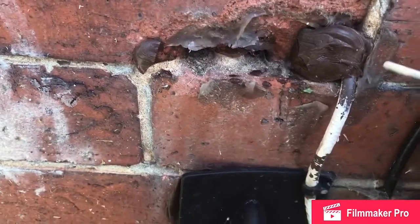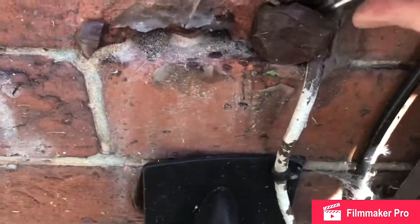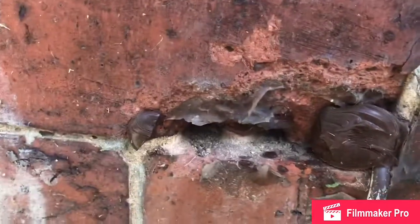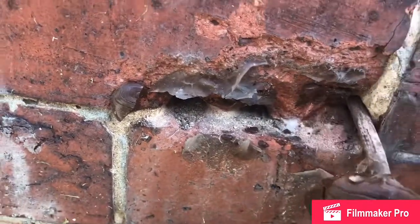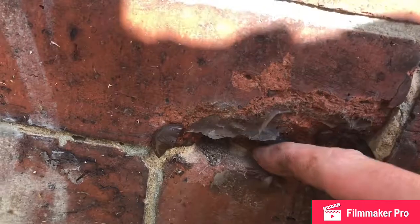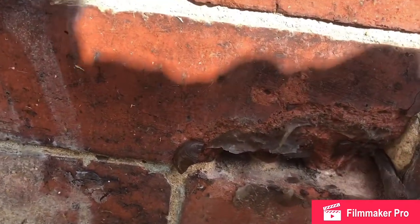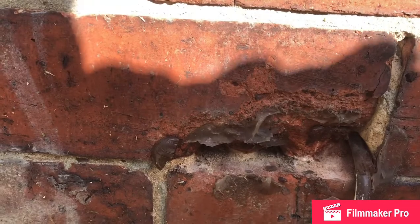It's quite dry. We did have ant infiltration. This should verify. We have had a bit of dry weather, so I'll assume it's just dried out. It's been a bit more than a damp problem, it's actually been an ant problem. There's a cable there, pretty loose. What I'm going to do is get a mixer, clean this out further, get a mix of cement, repair this brick, and then put some silicone in the hole there before I start. And then when it sets, I'll re-silicone that area.